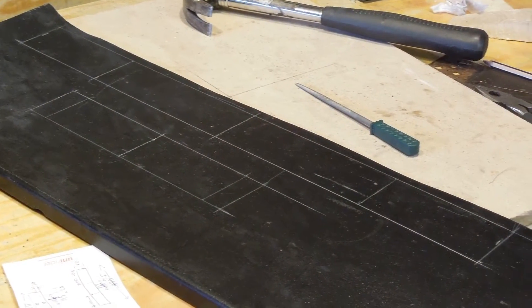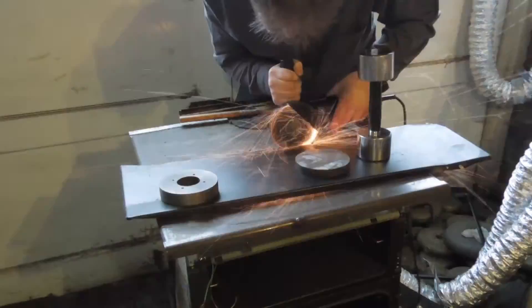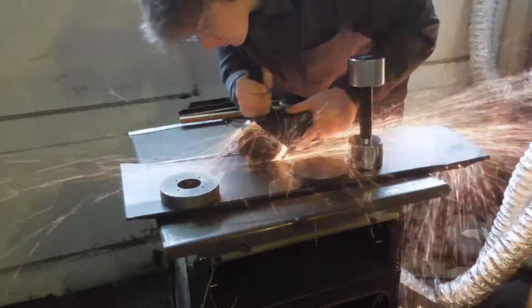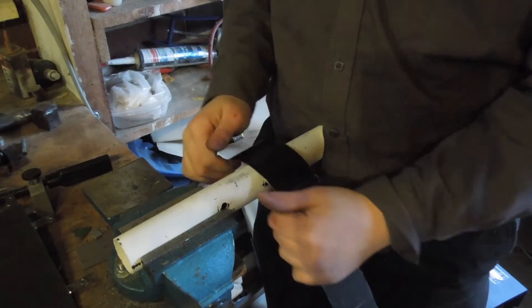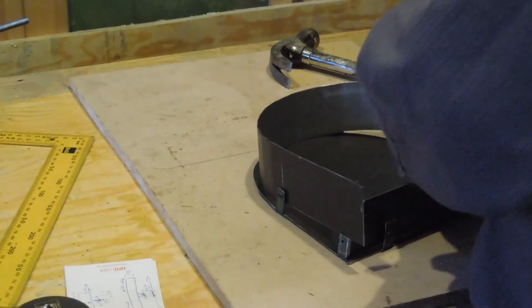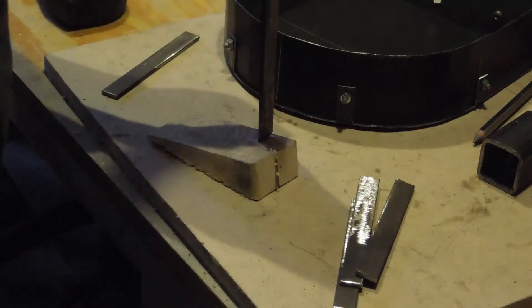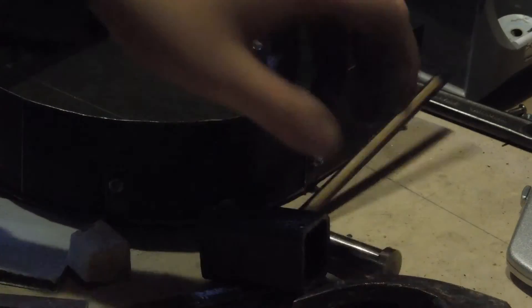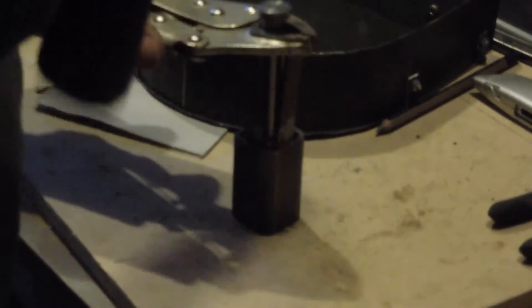The edges of the platform were laid out, then cut out, then bent to fit the base, and then assembled. I decided to try a different way of holding the steel strips in place for welding, using a tapered wooden plug. It took a few attempts to make the fit right, and of course when I finally got it to fit the camera didn't focus right.